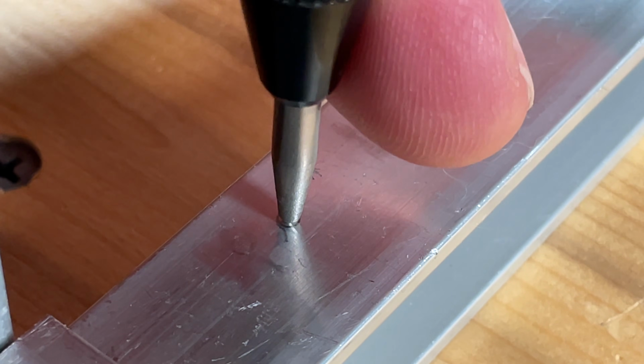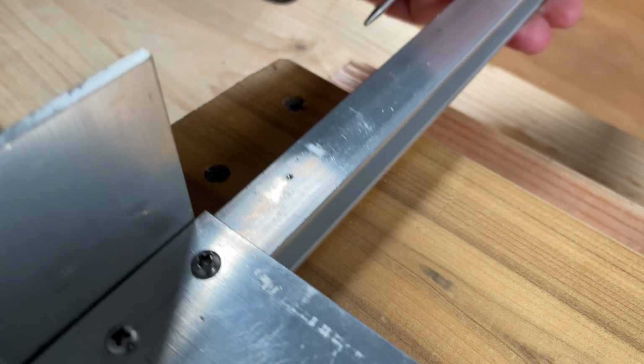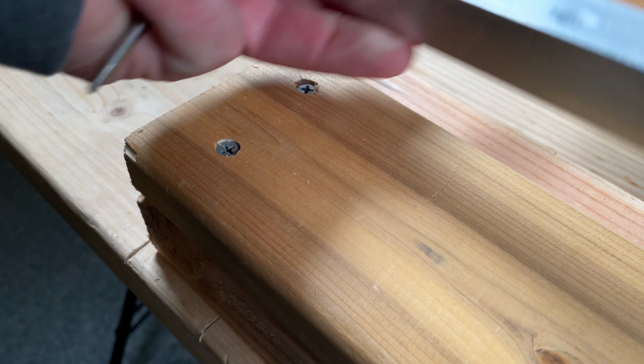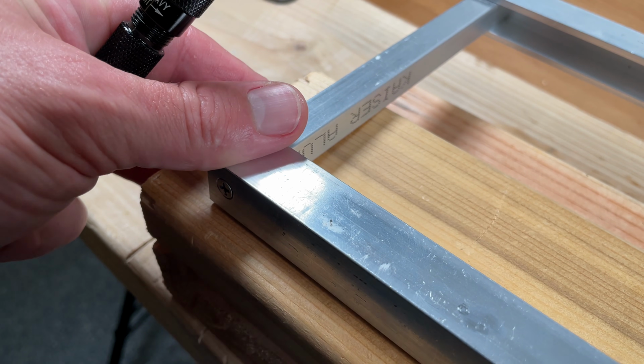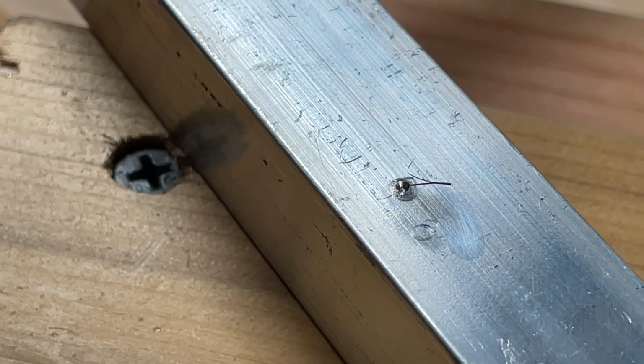You put the point exactly where you want the motherboard standoff to be, and the drill bit will dive into this conical depression and center itself. If the drill is allowed, it will wander and goof up your layout. This is a problem even if you use a drill press.